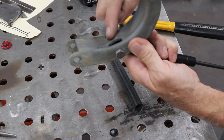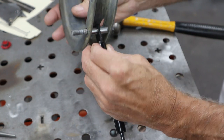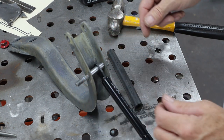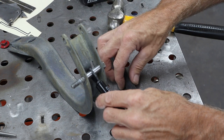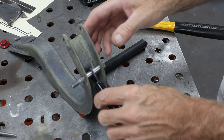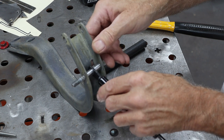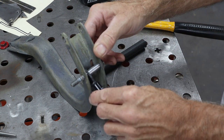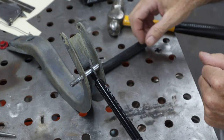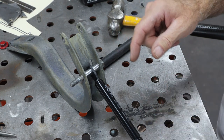Here it is - I got the little dent over here, you can see it just poking up a little bit, and that gives it the clearance it needs so it can swing through there and not rub. I got the bushing cut down and it fits in there nice. To keep this from wandering back and forth, I've got some irrigation tubing to act as a spacer so this stays dead center the whole time - I want it pushing dead center, not off to one side. I could have slid this over and used one of the slots, but I'd rather have it push right dead center so it's not twisting the hinge one way or the other.